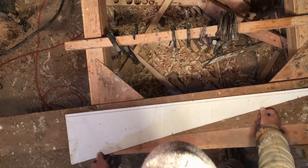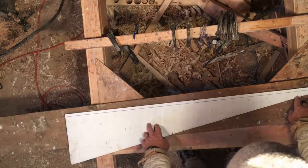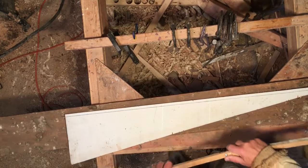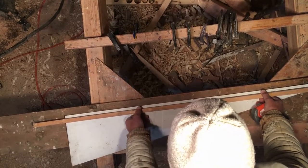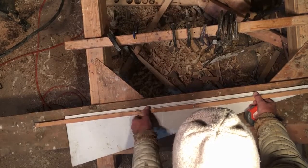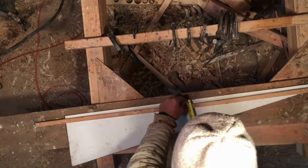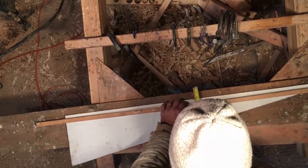To show up better on the video I've replaced the board with a piece of scrap plywood to simulate making this arc. I've redrawn the offset line at half inch. Now we're ready to take our long compass and get it in the right position for this particular arc. Place the long compass on our offset line and then we're going to bend it with the center nail.